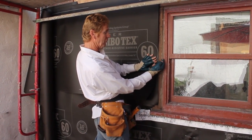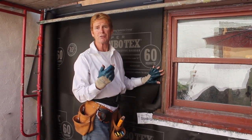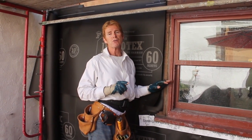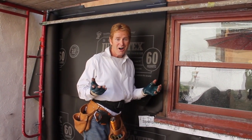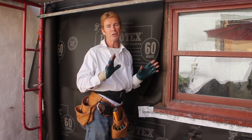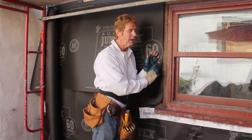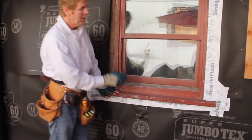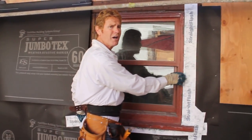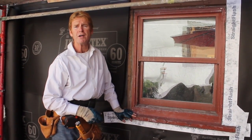Our stucco here is going to be bullnosed — rounded off like the rest of this house. Anyway guys, that's another way to do windows, because a lot of you folks email me and say the windows, when they tore all the stucco off, there is no flashing. Of course not — that's new windows. When you rebuild a house you put new windows on and they'll have a flange, but we don't have that luxury here. The paper in the groove with polyurethane is another way; this is the best way though. Whatever type of peel-and-stick you choose, they make about 20 different ones — I'm just fond of the DuPont stuff. Anyway guys, my name is Kirk, I'm with Kirk Giordano Plastering. We thank you for watching, and as usual, we'll see you on the next one.